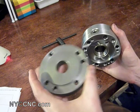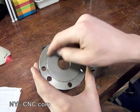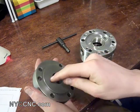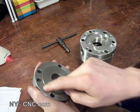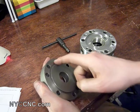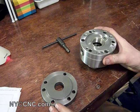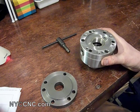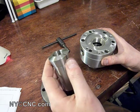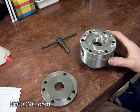So you need to order part 1692 and turn down this outside diameter to match the lathe chuck backplate. I didn't do a perfect job — I'm off by about a thou and a half, which isn't that bad. But when you're using a collet chuck, you want to minimize any error. I'm using less expensive collets as well, which have probably a thou or so of runout. Sometimes the errors can compound such that it's not ideal.